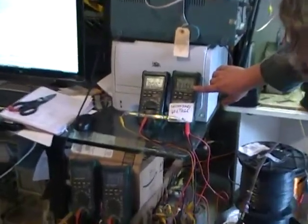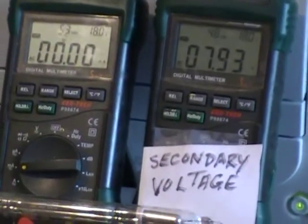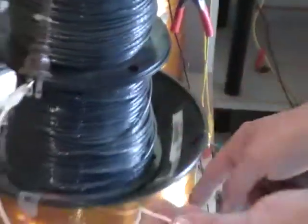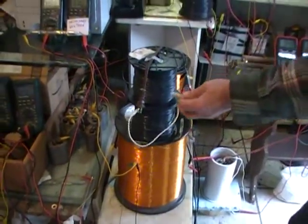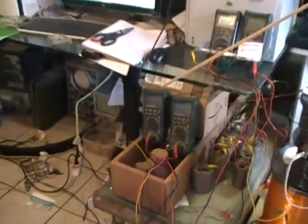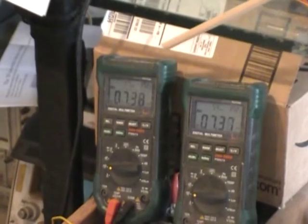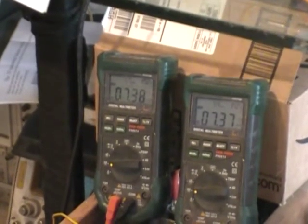So we can see that there are some peculiarities in the system, but more importantly, now there is no place for the induced current to go on this coil. We've just removed its short path. The consequence of that short path being removed is that it has taken the entire other back coil system as the short path, and we have 7.3 milliamps on each coil in that situation and 7 volts across the load.